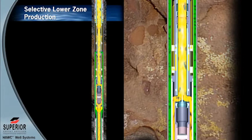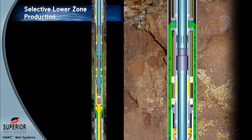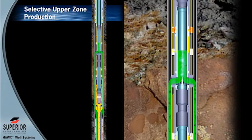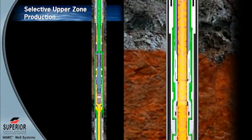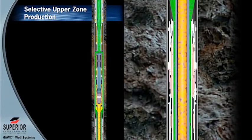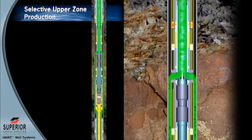Production is always shut in or isolated at the tree prior to shifting any downhole hydraulic sleeve. The utilization of downhole surveillance equipment provides the operator the ability to capture flowing temperatures and live pressures on multiple intervals at all times. To change the production flow path, both hydraulic multi-service valves are closed and the well is isolated or shut in downhole. The upper interval is placed on production by hydraulically opening the upper hydraulic multi-service valve sleeve. The production flow path is through the upper zone production screen, around the upper isolation tubing, through the annular flow valve, into the annulus surrounding the lower zone pressure containing shroud, and up the annular flow path into the upper hydraulic multi-service valve.